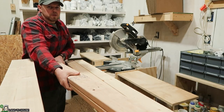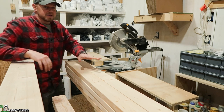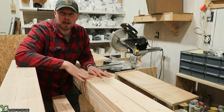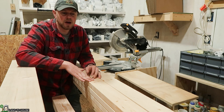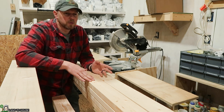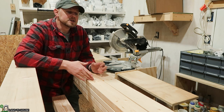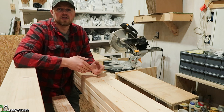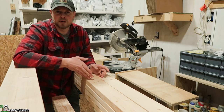Let's start off with our 10-foot 2x4s — the 8-foot boards will be used for the slats. You may be thinking, why not use two sheets of plywood for a solid base? Keep in mind that mattresses need to breathe, so having slats is important. Also, the reason I'm using this many slats is because I'll have a mattress without a box spring, so I need about a 2-inch gap or less between each slat to stay within the mattress warranty. If you're going to use box springs, you could cut the number of slats in half — instead of 15, just use around seven.